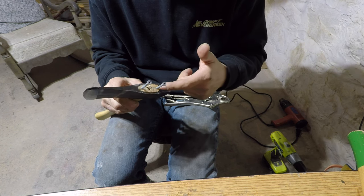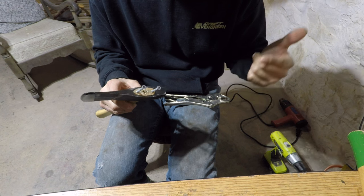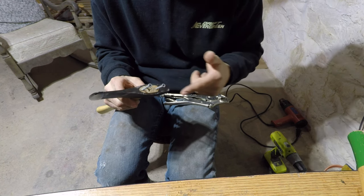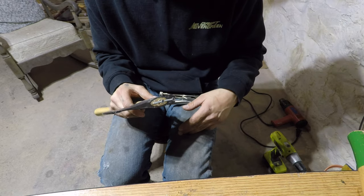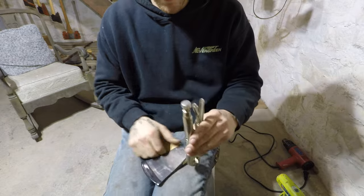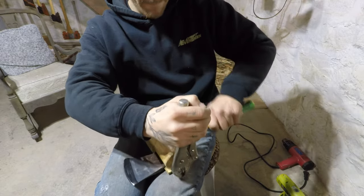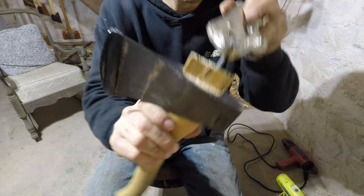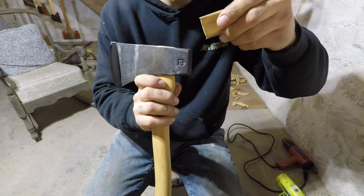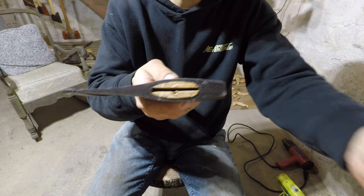If this doesn't work out we're going to drill out the wood in its entirety with the drill bit — that's a little tedious because you don't want to damage the handle at all. We'll only resort to that if we cannot get this wooden wedge out, which I don't think is the case. I switched the screw to the center hole — and there we go! Just a little bit of patience. We got our wedge out, the kerf is free and clear — the whole wedge is here, we didn't break off any sections.